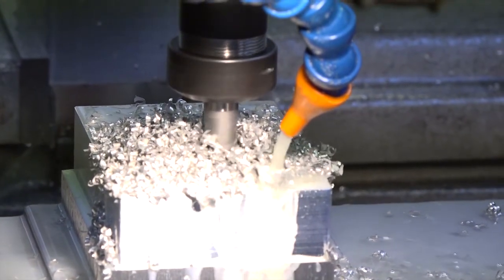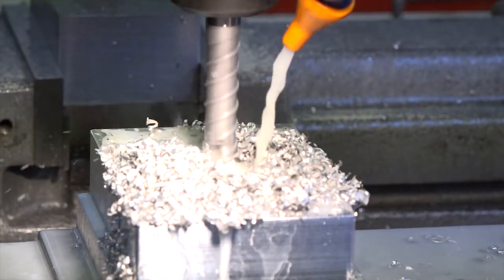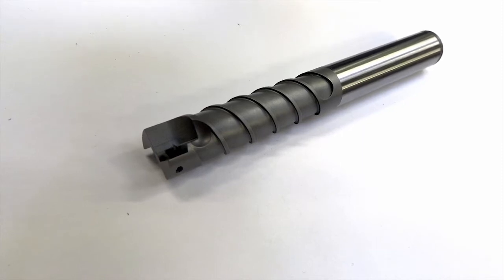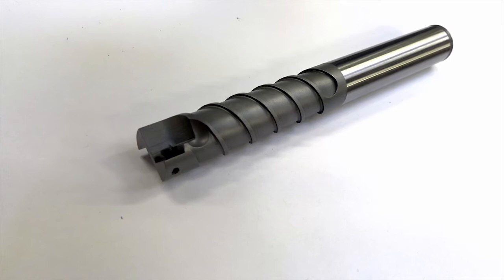Very flexible in that aspect, but only a small number of tools. In terms of the drilling — how does that work? The smallest size of tool in diameter is 10 millimeters, so it has to helix at 13 millimeters. In helix form it goes down, actually cutting in a milling sort of form — not just plunging like a normal drill — so the forces are a lot less. It works calculating-wise on its pitch, similar to a thread mill, so you're generating down and producing a short chip with a waveform on the end of it.